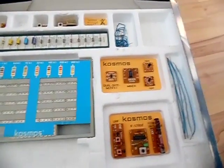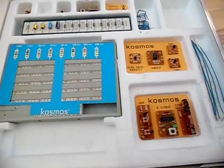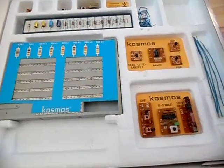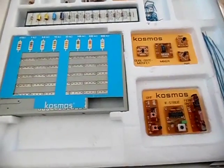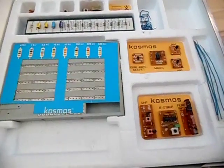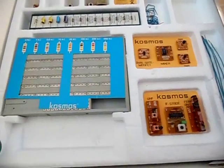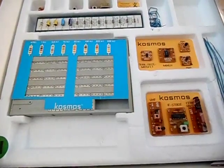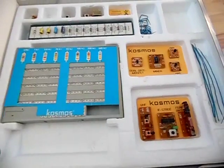As for the quality of the kit — it's excellent. You get good explanations of basic electronics, class A, class B, and I believe even a class D amplifier, a basic Morse code transmitter, oscillators, and more. What I do miss is a crystal — they could have included a 1 MHz crystal, which was popular at the time. There's also no super-regenerative receiver, which is a missed opportunity.